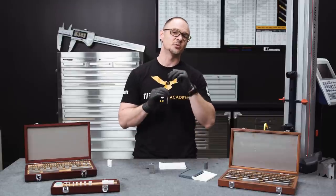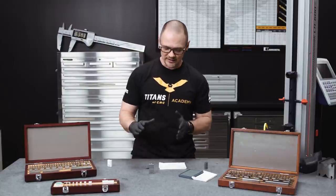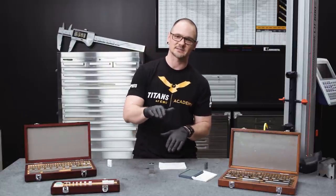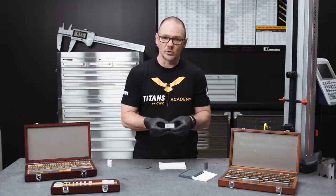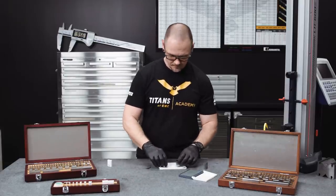All we know is that it does work. Done correctly, the distance between those two joined surfaces should be somewhere around a millionth of an inch, which allows you to create extremely accurate stacks. Another phenomenon with ringing gauge blocks is that the longer they stay rung together, the tighter that connection becomes — so we recommend breaking them apart when you're done. Although the force is pretty strong when pulling directly apart, if you just twist them, you can usually pop them off. Be careful not to damage the faces, and if you have a steel set, apply a little rust-preventative oil to increase their longevity.